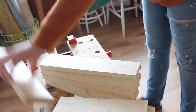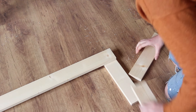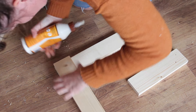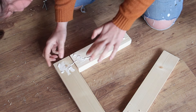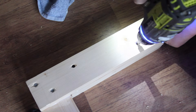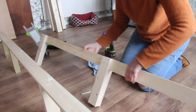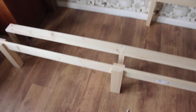We're going to assemble the front: it's going to be one long piece, and for the legs we're going to glue and screw a piece of timber on the front, one in the middle, and one at the back. This frame that you're going to pull out is going to be the length of your single mattress, so 190 centimeters. Make sure the leg in the middle actually lines up with the legs of the frame you just built. Now we have the length of the sofa frame and of the frame you're going to pull out to create the bed.